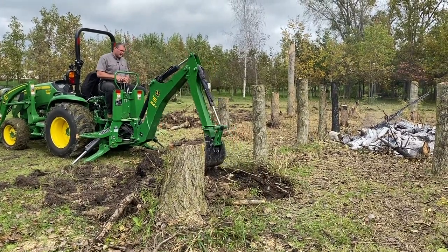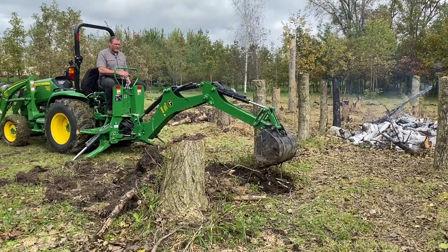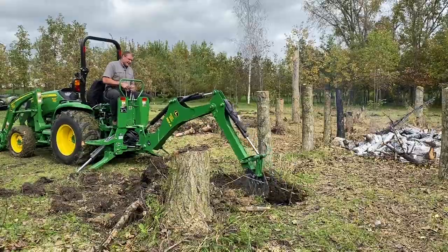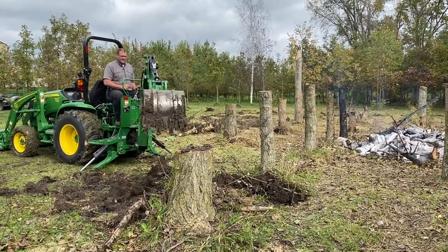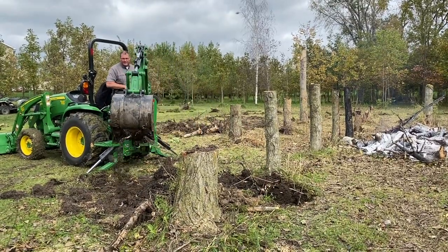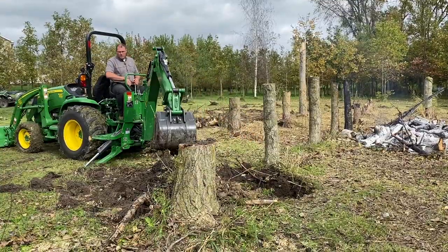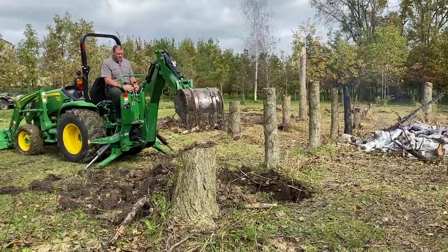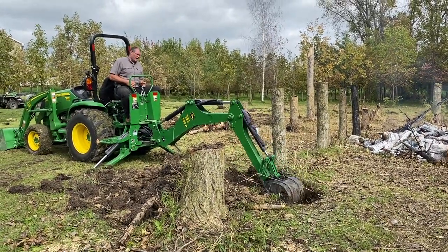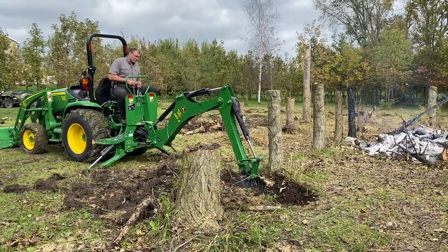This is a great way to wreck your backhoe. If you've got that hydraulic arm that does the bucket tilt all the way extended and then you start cranking and wrenching on it, it's going to bend. I've seen Tractor Time with Tim bend his — and I've done it myself. I'm never going to wrench on it again the way I did, because I don't want to pay for a hydraulic ram repair. Fortunately I was able to get it taken care of under warranty in my case. Another trick you can do is tilt a little bit — I want to get as much mass off the bottom as possible because it's going to be really heavy — and that'll scratch the wall off a little bit along the base. This is going really well; we got lucky with not having a lot of roots right down under there.